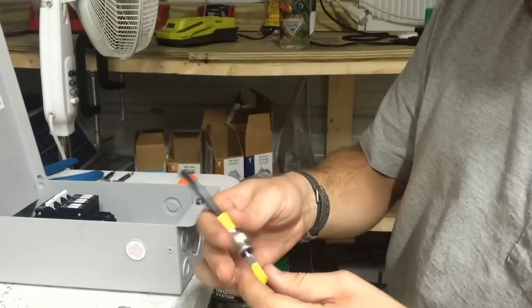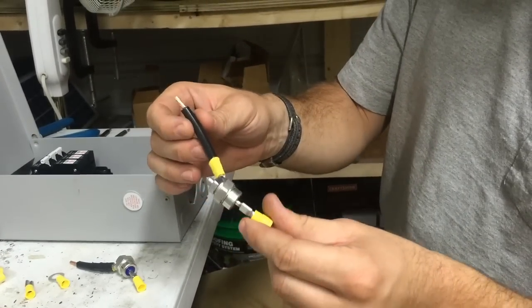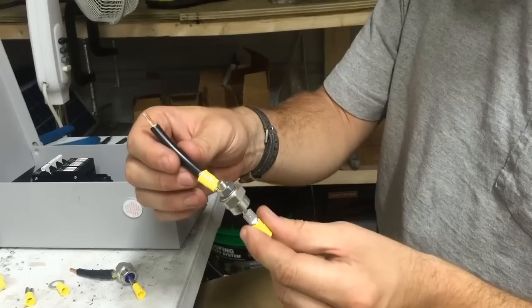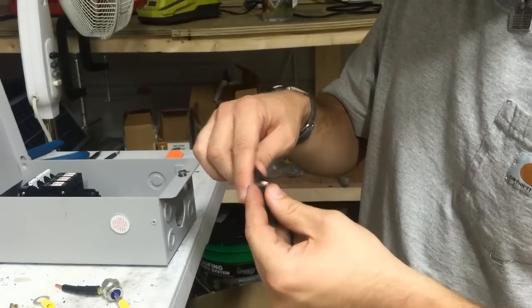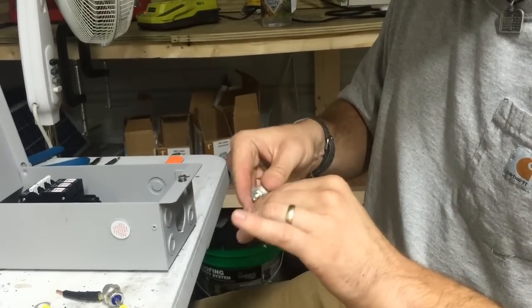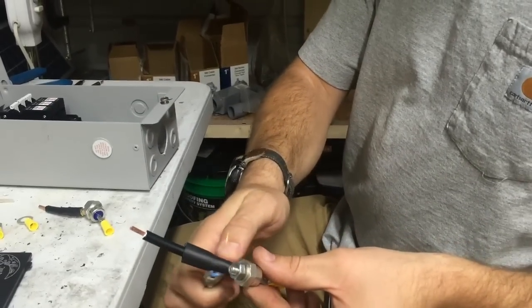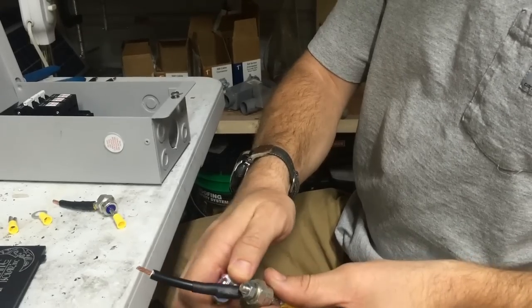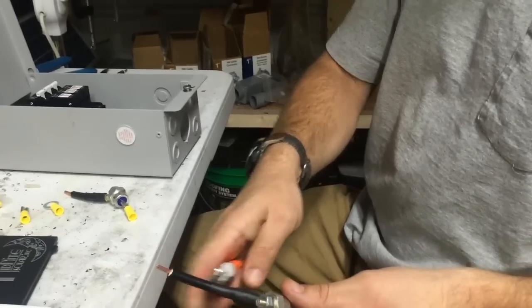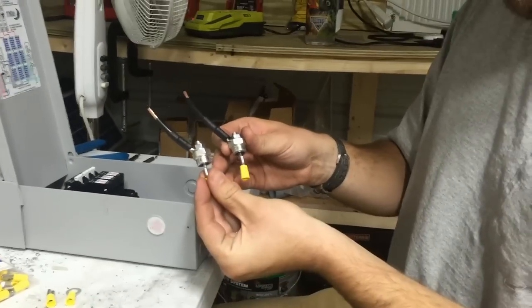You'll strip the ends of the wire. Once you've done that, you should end up with the following setup. Just beat those ends on there, crimp them really tight if you have a crimper, and thread it down onto the nut. Then take a piece of heat shrink and put it onto the wire — that's just to protect it since you'll have this stored for a while. I do it the poor boy style, heat shrinking it just like so. Make sure it's nice and neat.